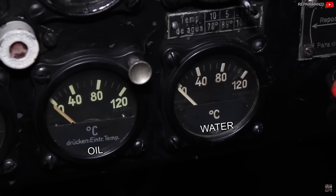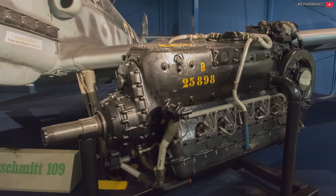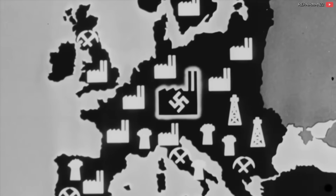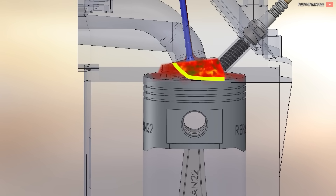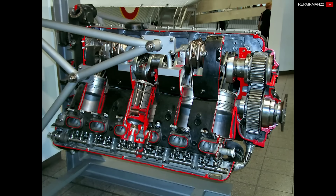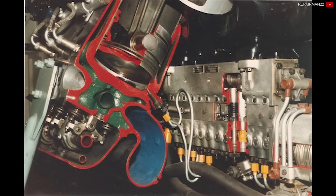However, this was not achieved satisfactorily and the operating temperature remained around 212°F. Since the engine was operating at high temperature, another problem appeared. The first DB600s were fueled by carburetors — reliable and well-known — but Germany did not have the capacity to produce high-quality octane fuels. Heat promotes knocking and, as a result of this uncontrolled effect, instant detonations can destroy the engine. The only way was to reduce the engine's compression ratio, which reduces power and worsens fuel consumption. The result was the DB601, launched in 1935, and with it the birth of mechanical gasoline direct injection.